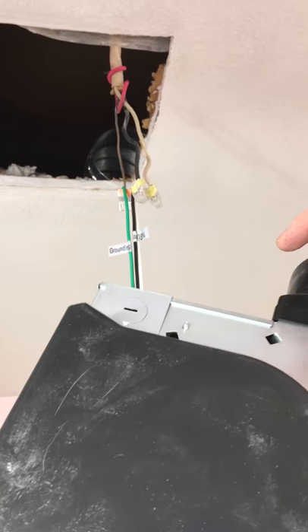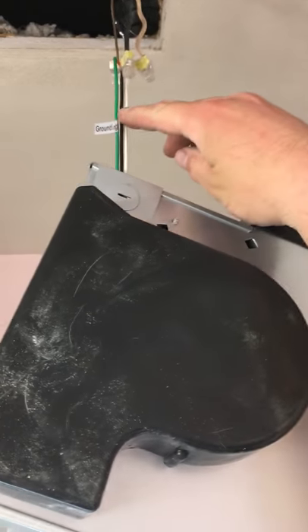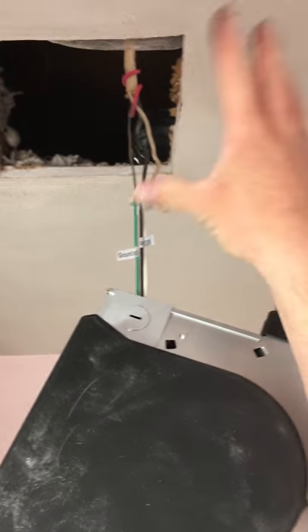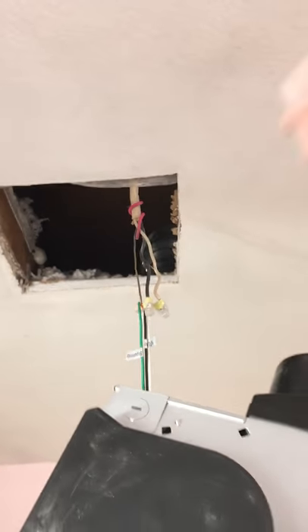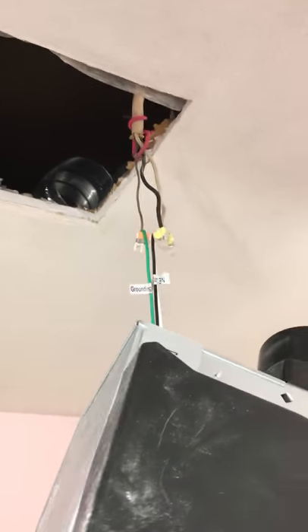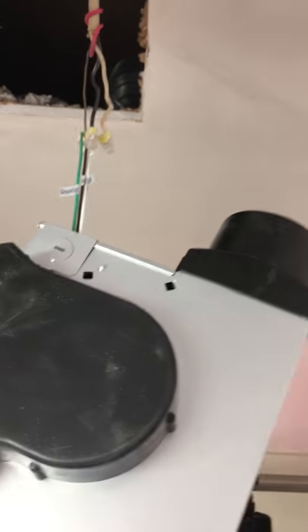According to the diagram in the book, this has to come from the light switch. So it didn't matter if I hooked up to the red wire or the black wire, because there's no energy — it's just a wire going from there to the switch. We connected the neutrals to the other bundle of neutrals in the light switch, and also connected the ground to the rest of the ground at the switch box.